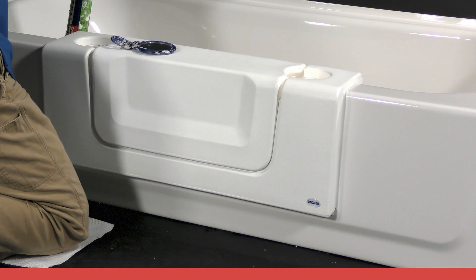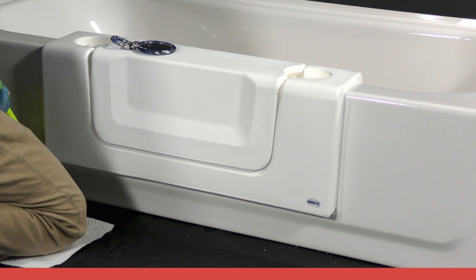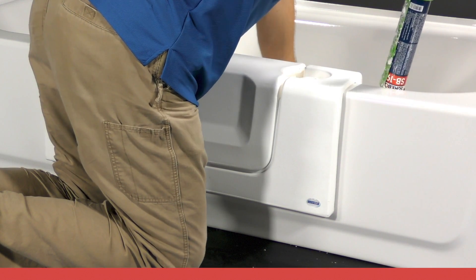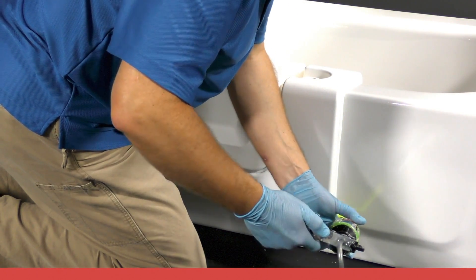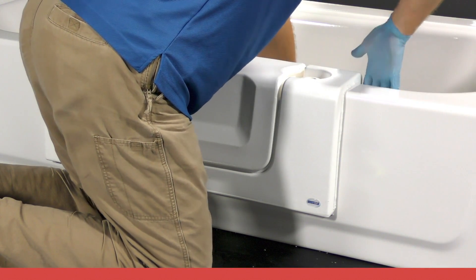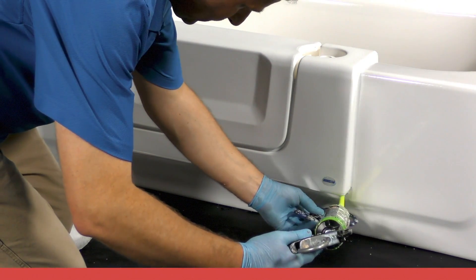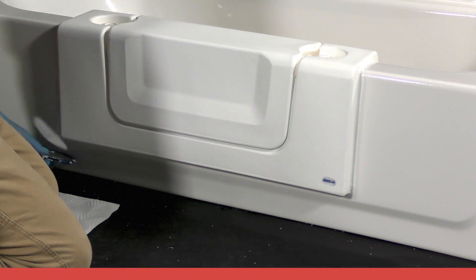It is necessary to caulk around the entire perimeter of the CleanCut product. Begin by using the recommended adhesive along the sides of the product, starting on the left side and completing the process before moving to the right side and bottom. It is recommended that you wear gloves during this step to avoid direct exposure to the adhesive. Run your glove finger along the beads and wipe the excess on a folded paper towel, trying to smooth the beads one time only. Underneath the bottom edges of the CleanCut product are a bit more difficult to see, and the angle tip should be used in completing this step. Use a small mirror to inspect the bead and verify that all surfaces have been properly sealed.